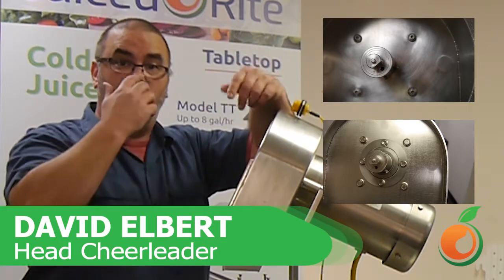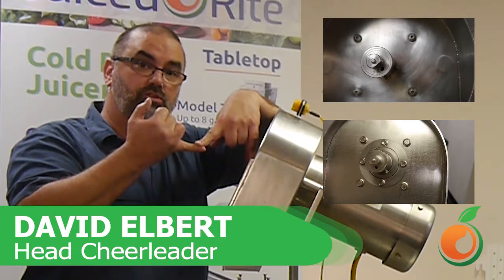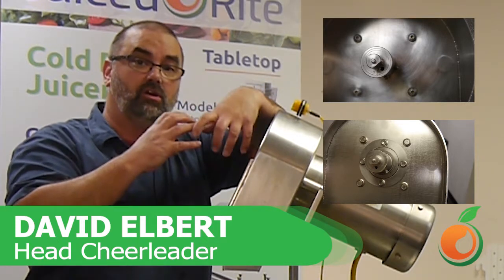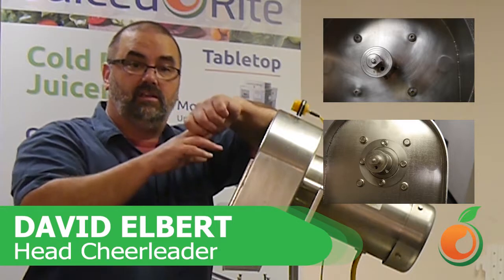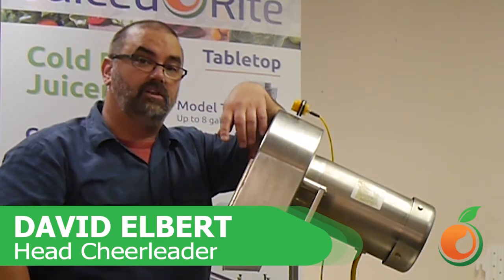The third carrier bearing is beneficial to the motor because it seals the motor from moisture intrusion. It's also a third bearing to carry the load of the shaft and the actual shredder plate itself. This added quite a bit of longevity to the motor.